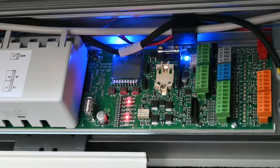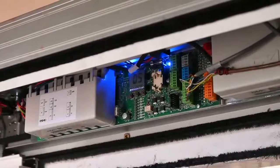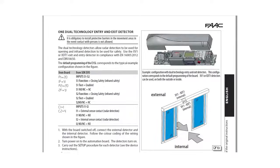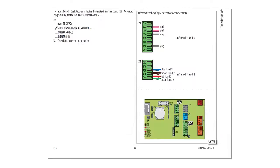L2 is the door opening. Once the door finds its open position, the display will automatically change from L2 to 03 and the door will stay in that position until a closing safety is re-engaged. Once you've run the setup, you can now install your activation devices, threshold safety devices, and opening safety devices as required. If you are using FACT branded devices such as the XDT1 for combined activation and threshold safety, and the XBFA for opening safety, simply follow the instructions provided in the manual. Thank you for your time.